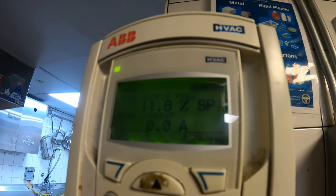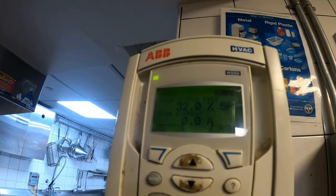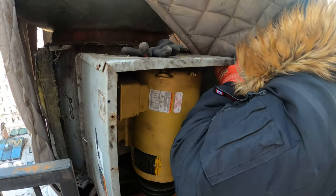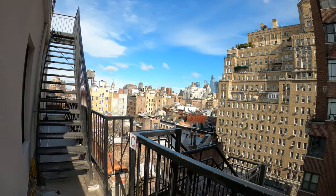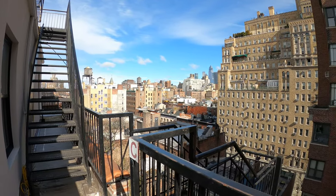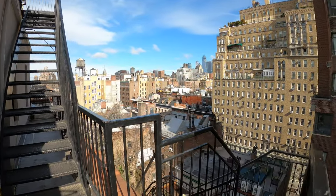Let's get the system back on. I can see it's at 33 hertz, so it should go back out to that 55%. Got no current yet — let's turn on the disconnect on the roof as well. Definitely looking a lot better. We're going to close up the covers, put the sound blanket back on, and wrap it up. That's how we properly changed the belts with good tension, greased the bearings for the motor and the bearings in the back, then tested everything — and everything's great.